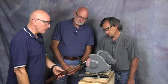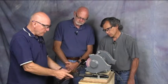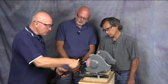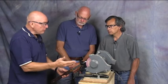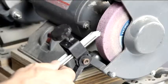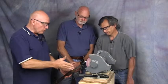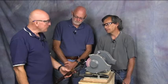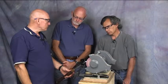What's the advantage of having the system at all? The big advantage is that we've trapped it so that it rotates around that center line. Most other systems simply have a tool that goes into a pocket, which gives you lots of freedom, but when you're first learning, you're concentrating on so many things it's easy for the tool to slip off the wheel, which can be very dangerous. This system traps it so it cannot come off the wheel — one less thing to concentrate on. It makes it much easier to teach a beginner; they get great results very quickly.